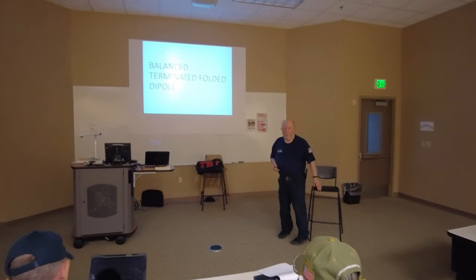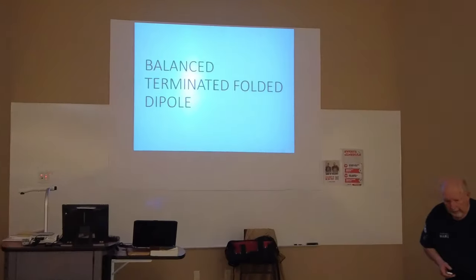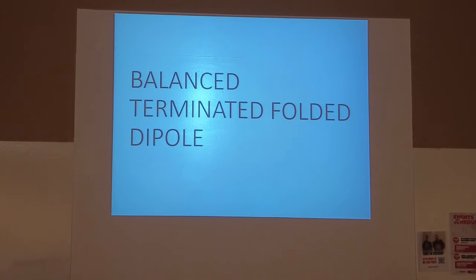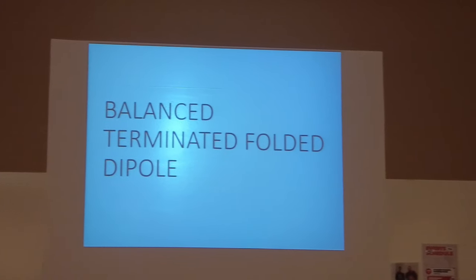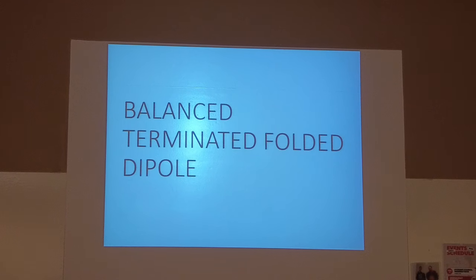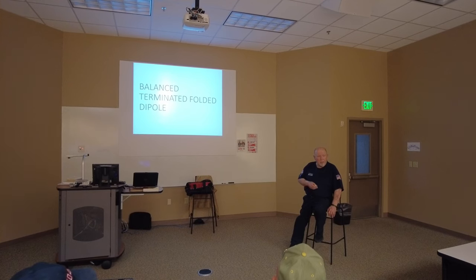Okay, here's one that the military uses and swears by. Now, I built one, and it was great. It was silent, it was quiet, and everything else. But when I got to really looking at it, my S meter showed the noise was down about S5 or 6 or 7, and on a regular dipole it was up around 10 dB over. It's really quiet. The problem is, I turned right around and tuned into WWV, which is 20 dB over S9 on a regular antenna. When I went to this antenna, it was down around S5.